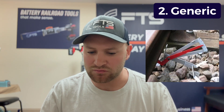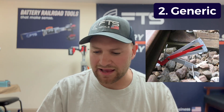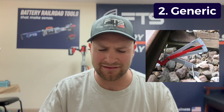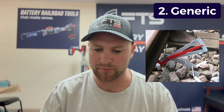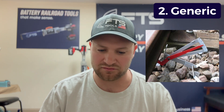Here's another device — it's a generic metal void meter without a brand name. It works very similarly to the Pell gauge. It goes underneath the base of the rail and you have to dig out the ballast again. As the rail moves up and down and gives you your void, it moves that red lever arm and gives you the measurement of how much pumping you actually had — your vertical deflection under full dynamic load.